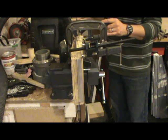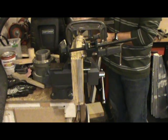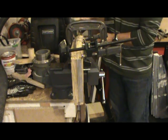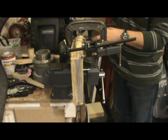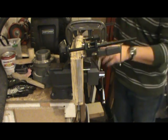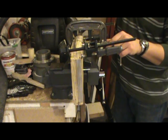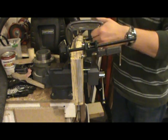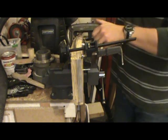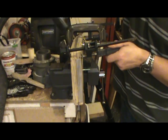The bolts are just for locating holes so it doesn't slide, but when we clamp we want to clamp the very edges to keep that metal tight. We start the process all over again — very gradually, just start that flange to bend, get it started just a little bit so that the radius starts bending on the first pass and gets the correct shape without buckling in the wrong spot.